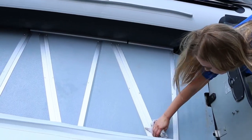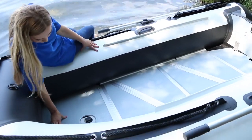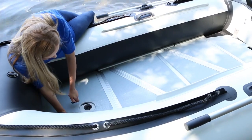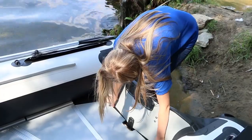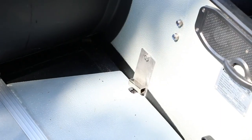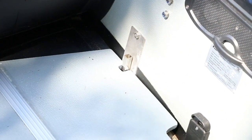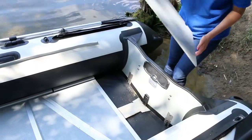The Polar Bird floor is taken apart while the main tubes of the boat remain entirely inflated. You can do it even on water. So, deflate the keel by using a special valve. Slightly push the stern section, then move and bring the locks on the boat transom into an upright position. Then start removing the floor by taking out the stern part of the boat.